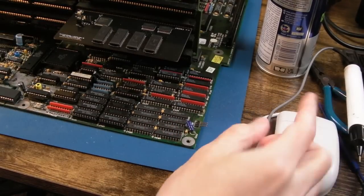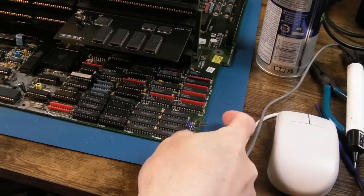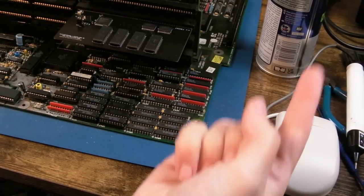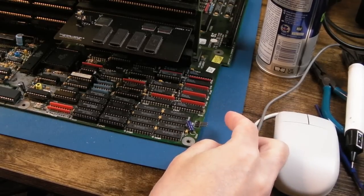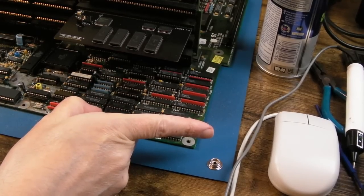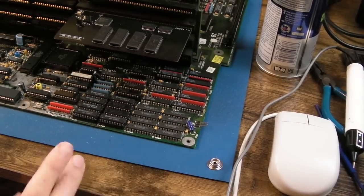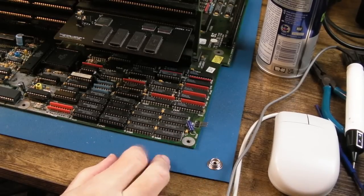There's probably a cable that connects on this with a PCB that's got a number of resistors on it and the LEDs, and that's why this 5 volts on here is, so that it can feed 5 volts to the assembly there and pull it high. I mean, we could test that. I'm not going to bother. I'm sure that's all right. I was just puzzled why I was not seeing any logic state change here, and it's because it's low, and when it toggles the other way, it's still low. Well, it's actually kind of high impedance, and that's where if you had a pull-up, it would pull high. So, yeah, the SCSI LED will test, because we should see a change. Oh, hang on, the SCSI LED works the same way, I think, doesn't it?